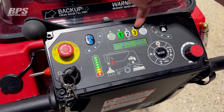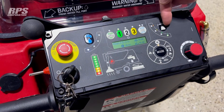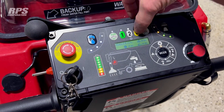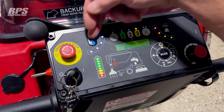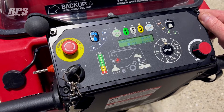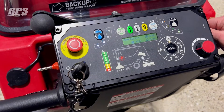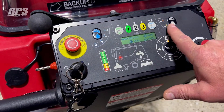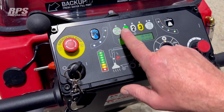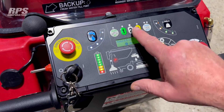We have these environment presets, much like our touchscreen. I can select number one, which is water flow one and scrub deck power one. Number two is at three and three. Number three is the highest setting — everything is maxed out. Once you've chosen one of those environments, this machine does not have lockout features, so you can easily go back and change the down pressure or water flow. As soon as you make that change, the light above the environment goes out because you've gone away from that environment. These are really just shortcuts to light scrubbing, medium scrubbing, or heavy scrubbing.